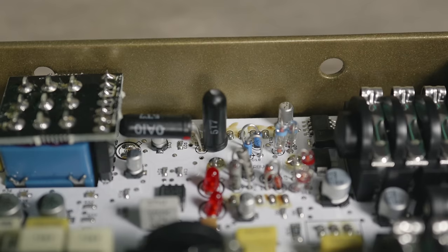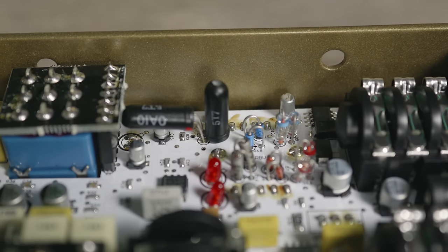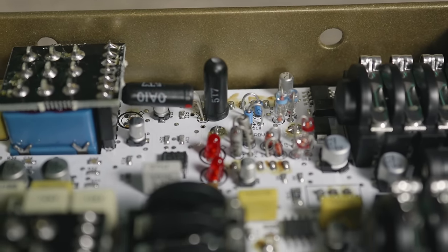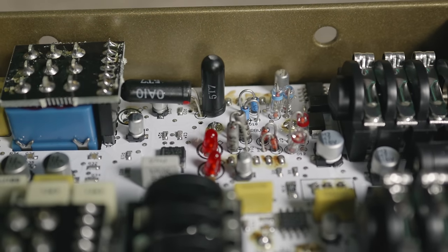So even though we're still talking about subtle differences, except for the last one, which is the LED clipping, which is much more open sounding, much louder, of course. But the other five clipping diodes and the original one, when the clipping switches off the normal Archer diode, they sound much more similar. That's much more of a feel difference than huge EQ changes, something that the audience would notice in a band mix. But you know how it is.